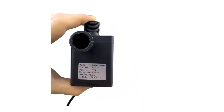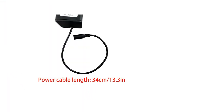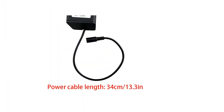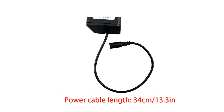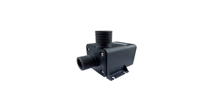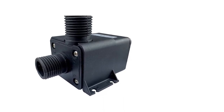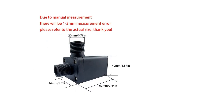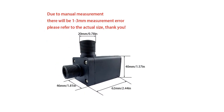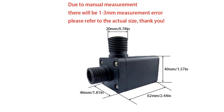The DC brushless pump is a centrifugal pump. The pump water flow decreases with the increase of the head. No diving without self-priming function. Prohibit running without water. Do not connect the pump positive and negative the wrong way. Prohibit connecting directly to the 220 volts power supply without a power converter. Pump is strictly prohibited for strong acidity, alkali and other media that damage the pump.